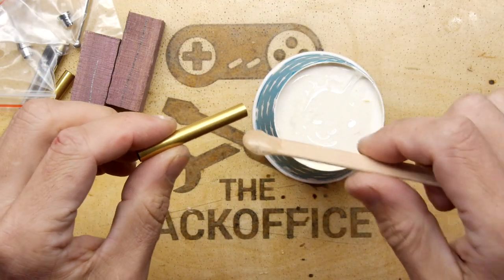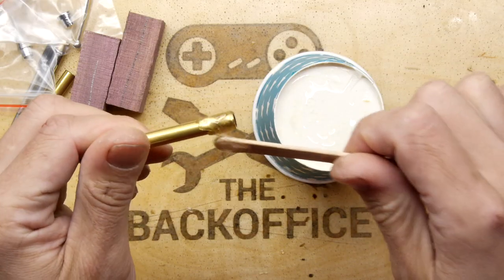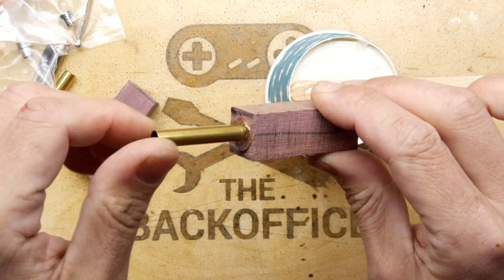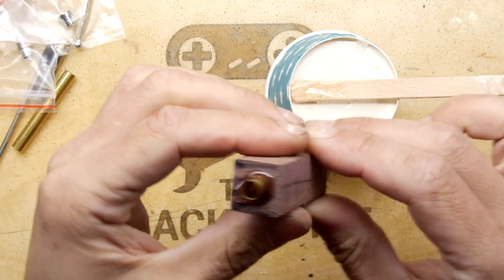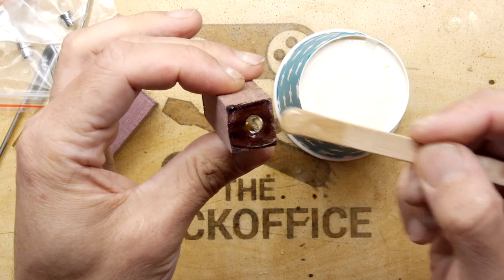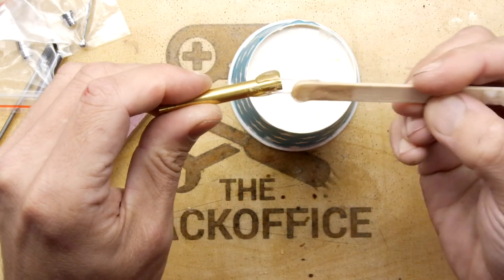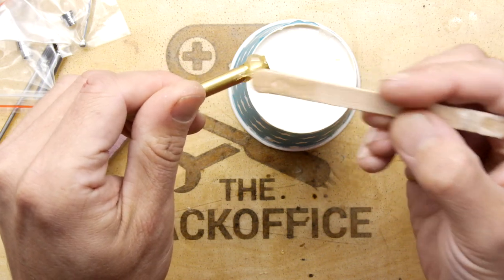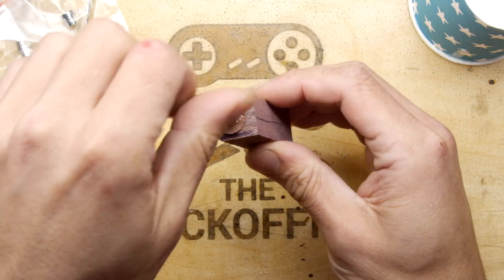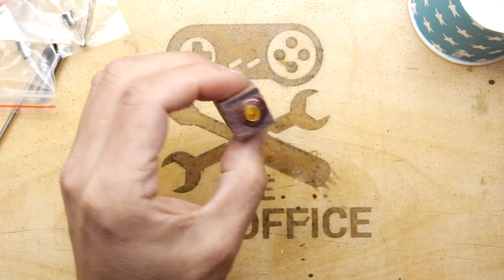The next stage is to lubricate the end of your tube with the glue. That should be enough. Always insert with a twisting motion, always inwards, never outwards. Otherwise you will fill your hole. Check the tube is thoroughly through and then spread glue on your end. Let's do that again just in case you weren't paying attention. Get the end nice and wet. Half an inch would be more than enough. Push it through, twisting motion, always forward, never back, all the way till it's completely through.